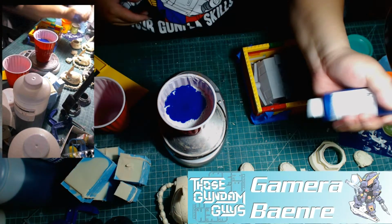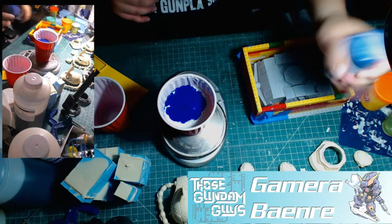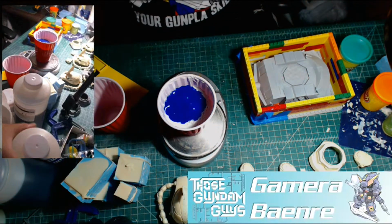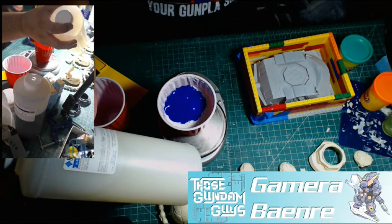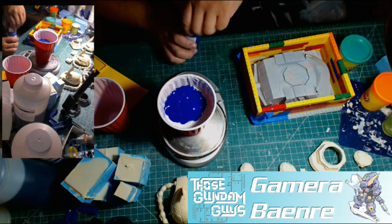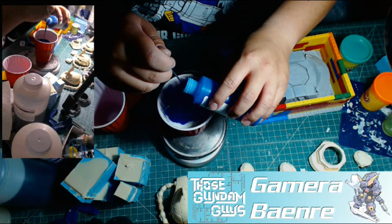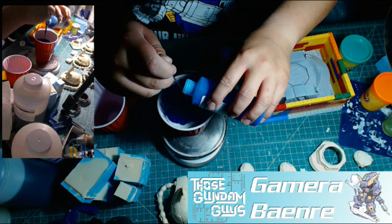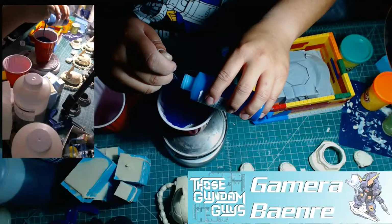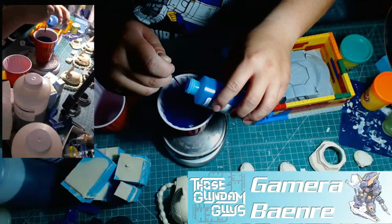This needs to be shaken up vigorously because the active ingredients tend to settle in the activators. It's the same thing with the hardener piece for the resin. You really should shake this up because the hardener tends to settle. So let's go ahead and start pouring in and try to reach my magic number. And if I go over a little bit, I'm not going to really care that much.